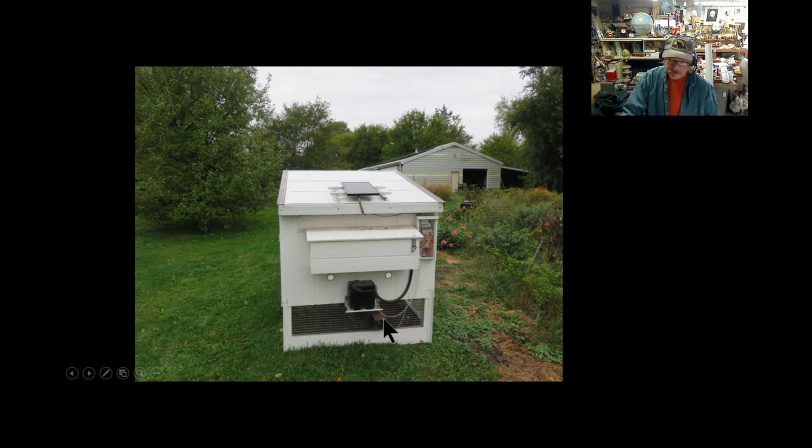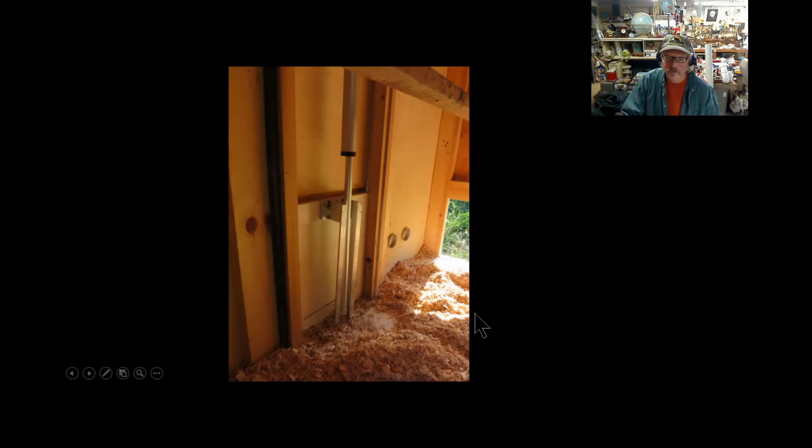These extra wires here go down to a fan I have, and also inside the cage in the bottom here, because I have an Arduino computer. I have a piezo buzzer that starts telling the chickens when it's time to go to bed, basically. And there is also a passive infrared unit down there, so it scans the bottom. If there's a chicken still in the bottom area, it doesn't shut; it delays shutting the door. And the same thing in the morning. If some perimeter has been breached by a raccoon, and there's something in there and it registers, it will not open the door if there's an intruder in the bottom, which has not happened, but I built that anyway. I'm going to talk a little bit about this voltage system I'm using for this breaking-the-beam system, because it's really an easy thing to do.